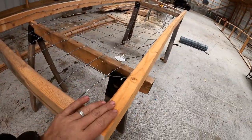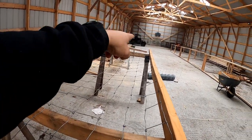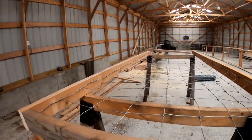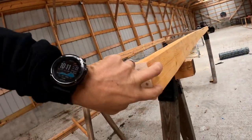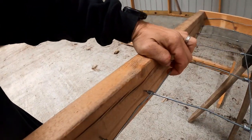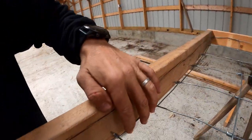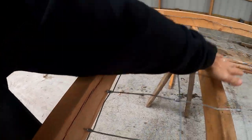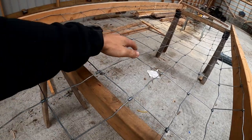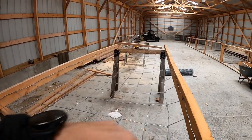She cut these boards at 39 inches, and the fencing boards at 10 feet because that's where we needed it on that end, with overlap that you'll see shortly. I'll put screws in the ends here and then attach this fence with staples here and probably here to make sure it's good and tight. You can see the boards are bowing in right now when I pull on it, but once we put the other pieces in it won't.